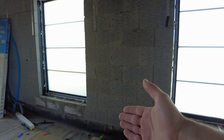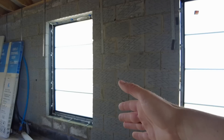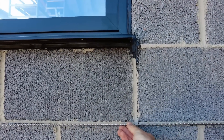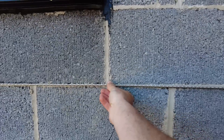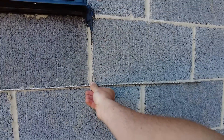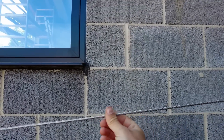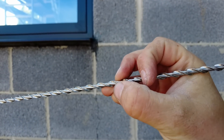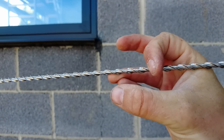I'm not sure whether it's worth stitching the inside as well — just grinding out a channel to link that side across and stop any further cracking. This will eventually be meshed, but with plastic mesh unless I do EML inside as well. Rather than doing this retrospectively, you can do it proactively as you're building using bed reinforcement — something I'd never heard of before.